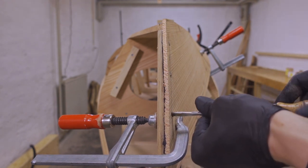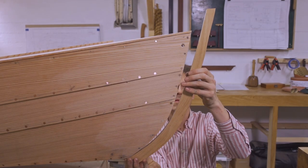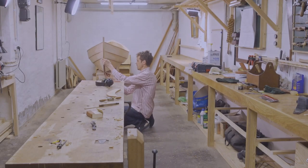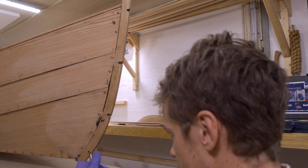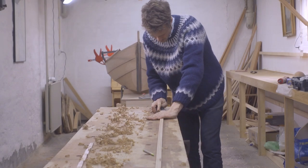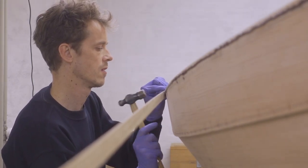Now I'm moving on to the outside of the boat. The Fiddlehead canoe has a two-piece stem. This means it has an inner stem where the bottom panel and the plank ends are attached, but it has an outer stem too, also known as a false stem or a cutwater. Here I'm shaping these pieces. They need to fit the inner stems, so I'm using their pattern to get the inside curve right. Once the shape is good, I'm beveling them to that pointy cutwater shape, then attaching them to the boat using bronze screws and polyurethane caulk. I'm cutting them off at the bottom and adding a protective brass strip. Finally, I'm finishing the head of the stem to a shape that I think looks good. To protect the shear planks and the decking, I'll add a guard to each side of the boat. These guards are simple hardwood strips with beveled edges that are nailed in place.